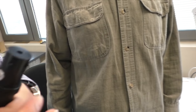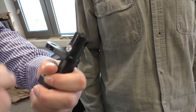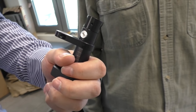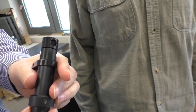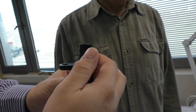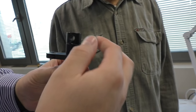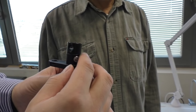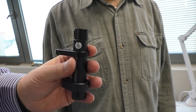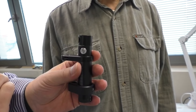Interesting. You don't see the mechanism, but it's all built in, and the distance between the magnets defines the force. Then the bearing. The horizontal bearing is low, it's here. The vertical bearing is here on top, but actually, this is the vertical bearing, so it's at the same position as the needle, at the level of the record.